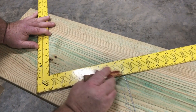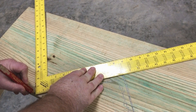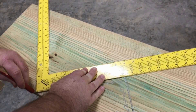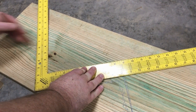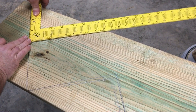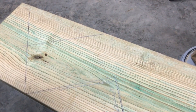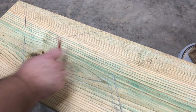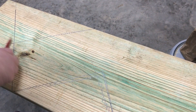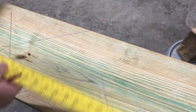You put this on 10, get that squared up, then come down to 6.5 inches and make yourself a mark. You need to make a mark at 6.5 inches. Now you've got to be careful with these when they get kind of thin — the way the grain is going straight, these little triangles will want to pop off. If you just drew a line from there to there, that triangle likes to pop off, so be careful with them.